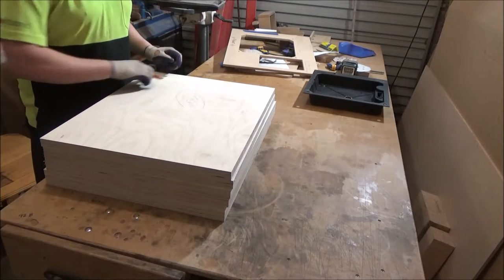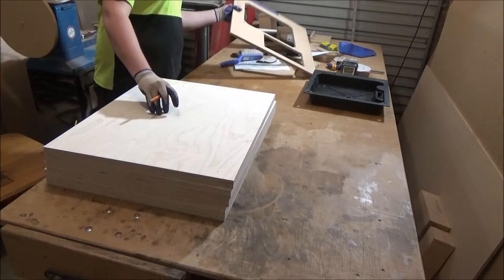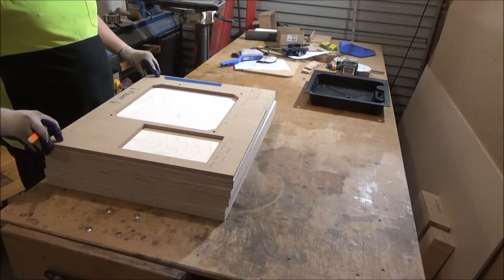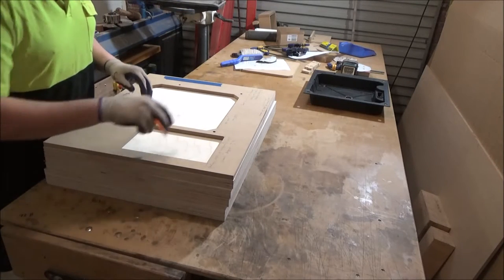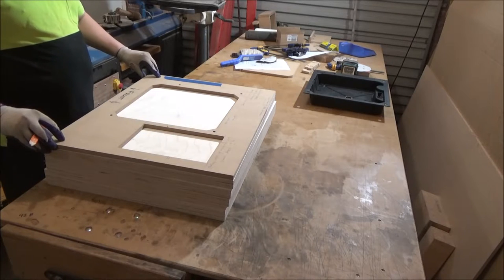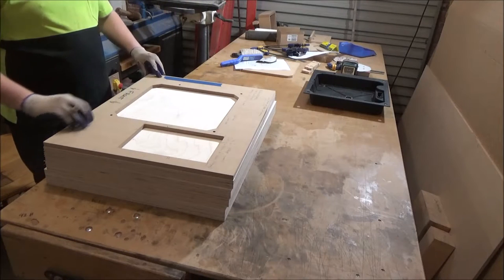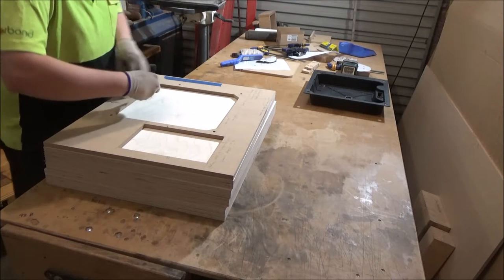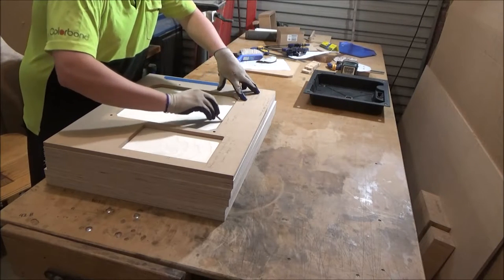This is all going to get cut out here, so I'll put that on the side because I don't need that one for a moment. And then on the next one, I need this. My panels are a little bit bigger than my jig, so I just have to make sure I reference always from the bottom left corner, which is what I'm going to do anyway - it's just a natural thing that I do. And then I can mark out on the first three layers and mark this cut out here, then cut it out with a jigsaw and clean it up with a router later on.